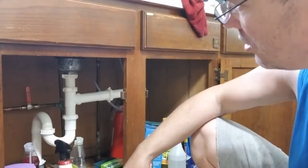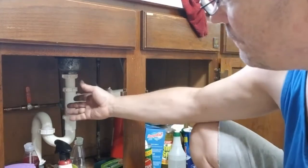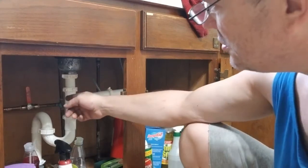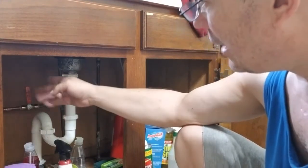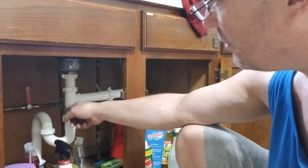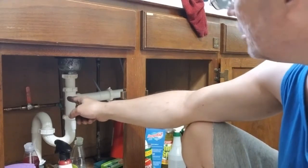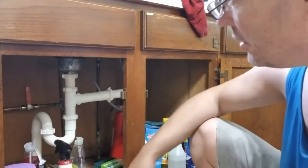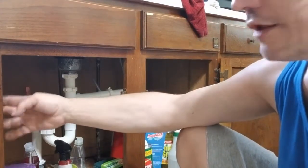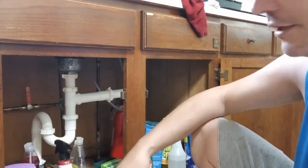The water is on, and even if I turn that valve on, it's not going to go anywhere — the cap's on it. It's just a fail-safe thing. I'm not a plumber, just some guy working on his house. I could have just soldered the cap on there, or used the valve without the cap — either way. I think that valve cost me $13 or $14, and the cap was $0.63. But it's a fail-safe. Now if I ever want to cut that off and put a water line in for a dishwasher, I have it right there. That's how you do it.